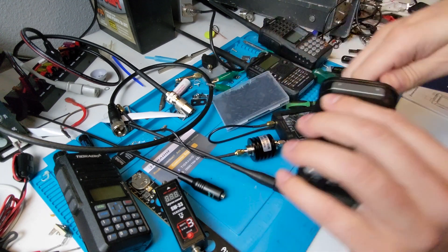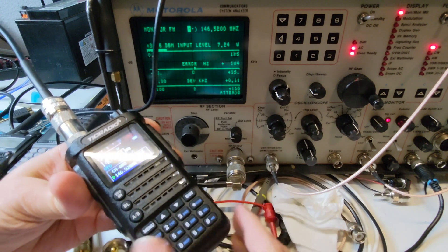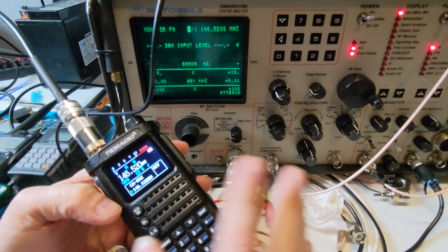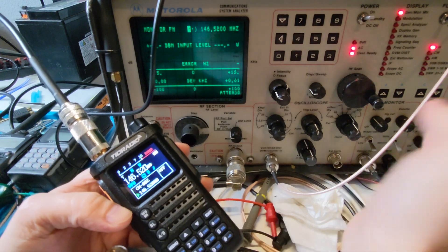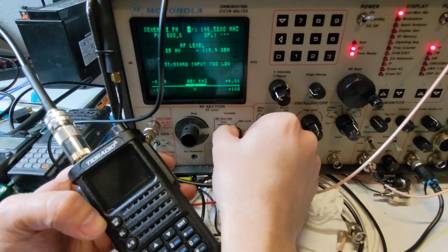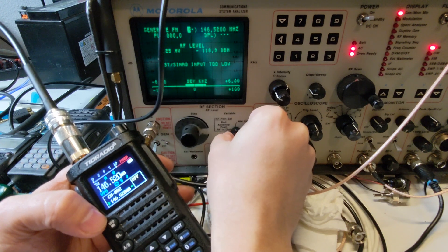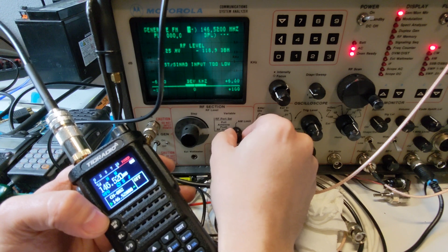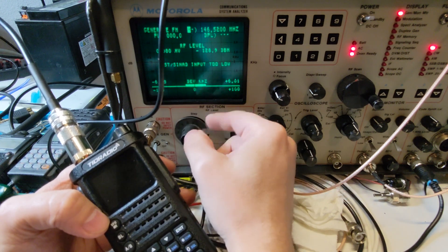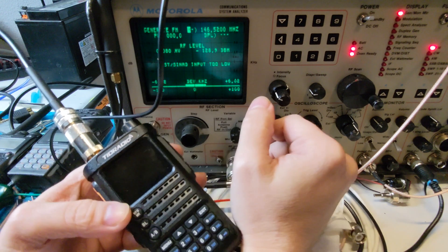I just realized we didn't do a power out — let me do that real quick. So there's low, one half... menu... and there's high power. Yeah, seven watts. I think this thing is being sold as a 10-watt radio, or maybe an eight-watt radio depending on the listing, but you're in that ballpark. We can also do some receive sensitivity here — oh yeah, that's pretty good. You can kind of get the squelch trying to kick in there. This particular knob I've got to get in there and throw some DeOxit down — one of the steps is not working properly. But yeah, that's pretty decent receive as well.